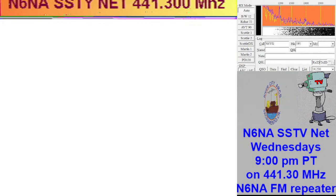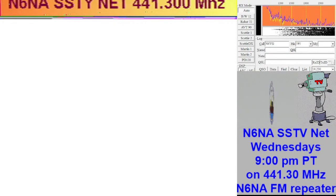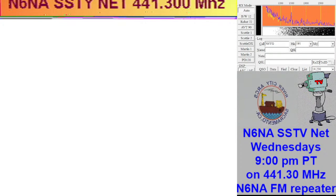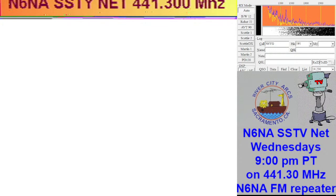But yeah, I do see what looks like a spectrum analyzer and power supply, and what looks like a Nano VNA, and there's a device there, a little black box, and it's got the power going to it. I don't know if it's a bandpass filter. That's kind of what it looks like, because it looks like it's doing a frequency response of a filter. But I wonder if that's an amplifier, because it's got power going to it. I'm suspecting that's what we're dealing with. We're probably dealing with an amplifier, and it looks like there's possibly an attenuator in the line going to the input of the amplifier. Back to you, this is KP4MD.